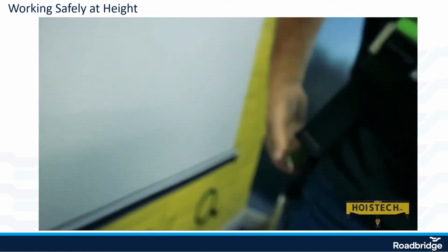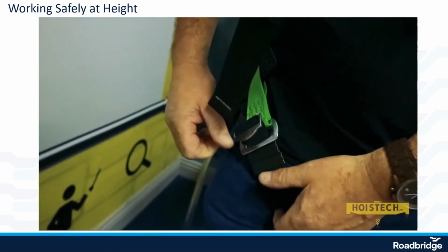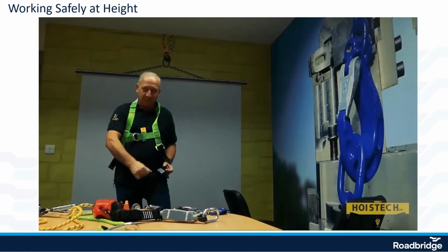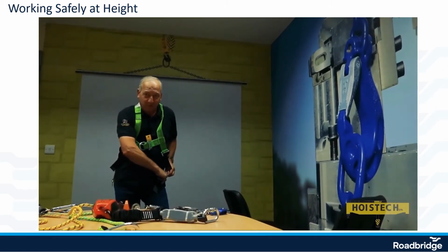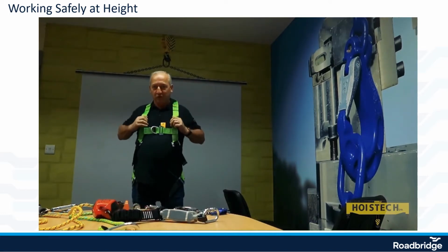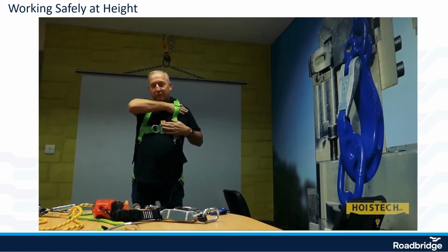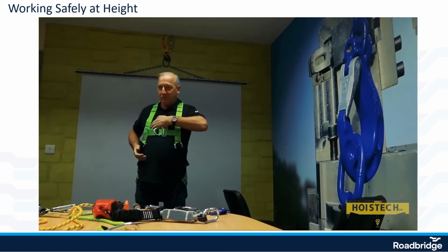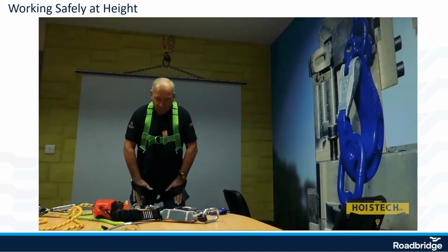Bring through the two leg straps, connect to the buckles, ensuring that the adjuster is to the outside, which ensures the leg strap is not in twist. Once it's fitted, we should ensure that it's fitted correctly. Good indication is that we can fit the palm of our hand between the shoulder straps and through the leg straps.